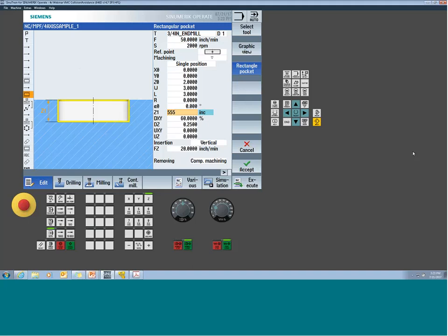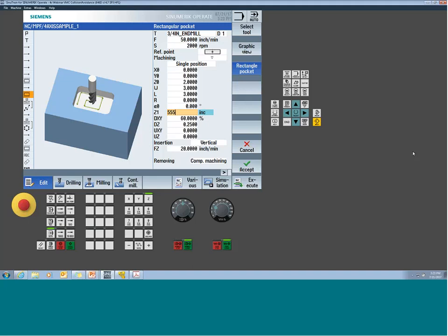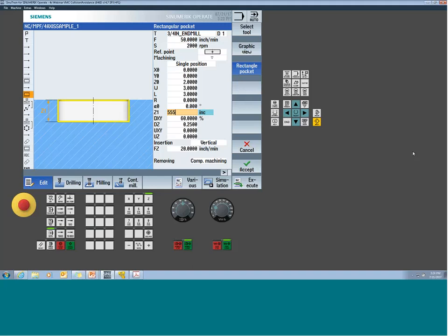He's referring to the command TRACYL. TRACYL is the G-code equivalent of cylinder surface transformation. So that's what we call it in the G-code side. Or is it calculated from the angle we start at? No, I believe it's calculated from the A0 orientation.